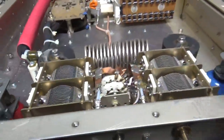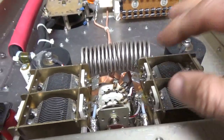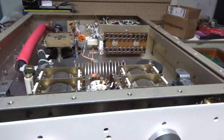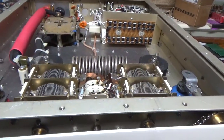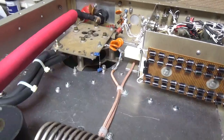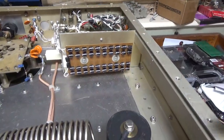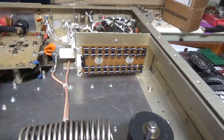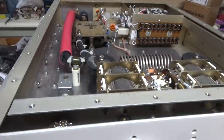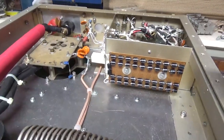Here's the input circuit. I use the TL922 output rotary switch — progressively shorting — for the input circuit. Again, 100% duty cycle. I didn't map out the settings for 160, 80, 40, 20, 15, and 10 meters yet. So I left the 50-ohm cathode resistor in — that'll come out when I go to test it. Bias diodes are in. I'm going to end up shorting some out and fine-tuning it. I might add a switch, which is super easy — that's why I'm leaving this hole open. I'm not worrying about that till it's up and running, and then it'll allow me to switch between two bias settings.